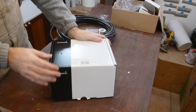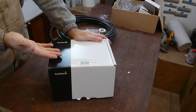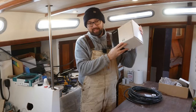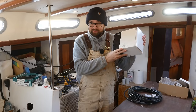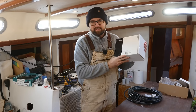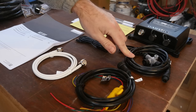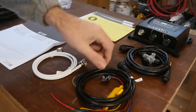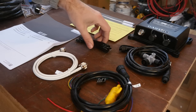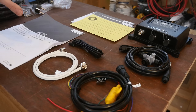Let's move on to installing the Garmin AIS 800 AIS transponder. I believe this is one of the newer class B plus transponders — last time I installed an AIS transponder there were only two classes, A and B. Here's everything that was inside of the box: the transponder itself, NMEA 2000 cable and a little T, power harness, a connection from the AIS transponder to the VHF radio, a little USB cable for programming the AIS transponder, and of course a manual.